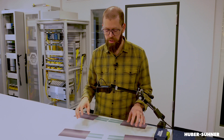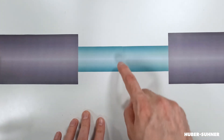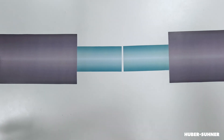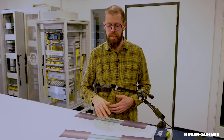With that flat polishing, when we mated two connectors, there was a huge area that was touching. Any even slight impurities on the surface accumulated, meaning it wasn't really possible to have a perfect mating, and we always had a relatively large air gap resulting in bad insertion loss and return loss.